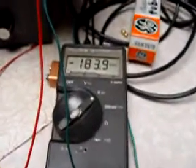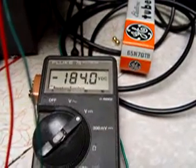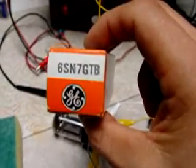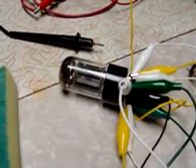The circuit DC output is 184 volts, using a different tube — it's a 6SN7GTB, a dual triode tube. They were popular in the 40s, maybe early 50s.